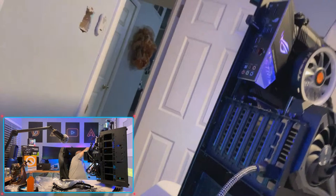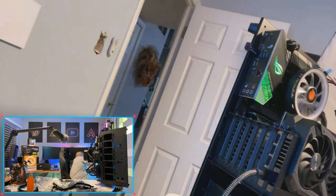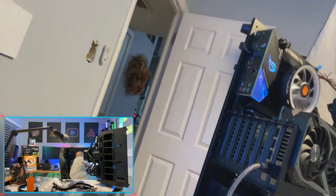Let's see. Connect USB, port on motherboard, yep. Shut down. Do not remove power. Press the button for 3 seconds until... Oh, see, you don't have to do that on the MSI. On the MSI, you just hit the button. Apparently with ASUS, you have to hold the button for, let's read a little further before we click the button. Let's not over-click this.